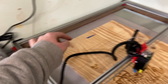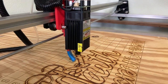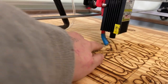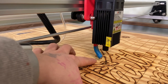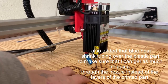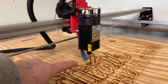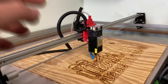Here is the compressor — a little fish tank compressor connected to my air assist, which is down here. The link for the air assist will be in the description. It's super simple — it prints in a couple of pieces, you put your 3D printer nozzle in there, put the tube in, and then bend it to sit right on your laser. It definitely cuts things a lot easier and faster. I'll also leave a link to the YouTube video from the man who made the 3D print design.